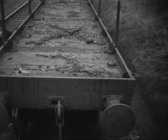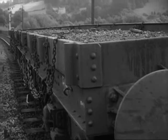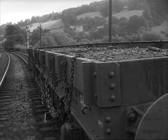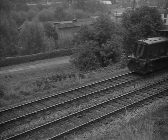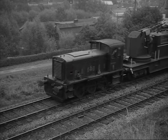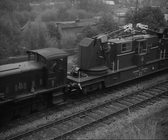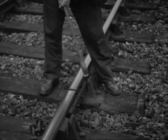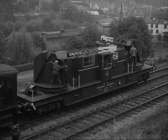The empty wagon is the last to go and takes up its place beside the cross we painted to mark the start of the job. We're all spaced out now and ready to begin. When the gang has taken the fish plates off the old track, the relaying crane can then lower its bells and start lifting out the sections.